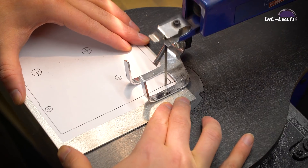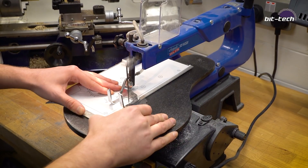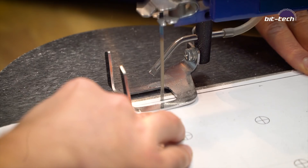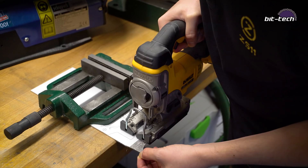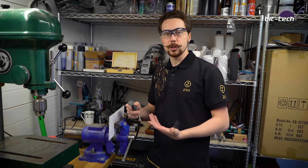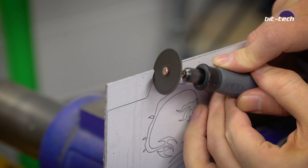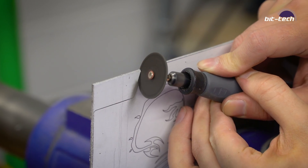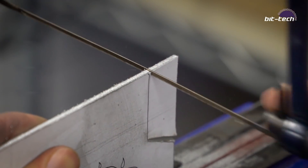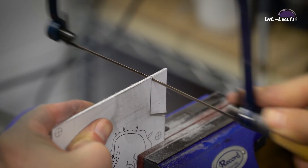This isn't an expensive machine. You can get many of these quite cheaply online, second-hand or in the junior models. This one isn't a particularly high-end model but it does the job very well for thin aluminium and even for steel and brass. If you don't have a scroll saw, you can also use something like a jigsaw — it's very good for these exact sorts of cuts. You can also use a Dremel with a reinforced cutoff wheel, though it takes longer and works best for softer materials like plastics. Another method is a hand saw such as a coping saw, which is very good for aluminium and plastics and has the advantage of being readily accessible and inexpensive.